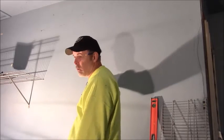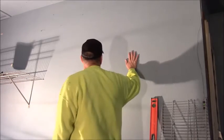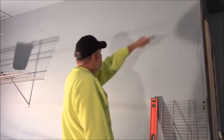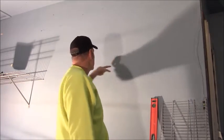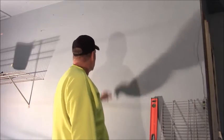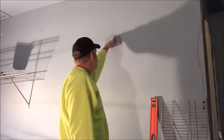You want to make sure you find a stud in the wall. You can do it a lot of ways — a stud finder, or the old tapping on the wall. I think the easiest way, especially in a garage like this, is to look for nail pops. There are little bumps in the wall, and they usually come in twos, because when you install drywall, you put nails or screws around the edge, and when installing in the field, you do screws or nails in sets of two. So there's a little bump there and a little bump there, so I know that's a stud.